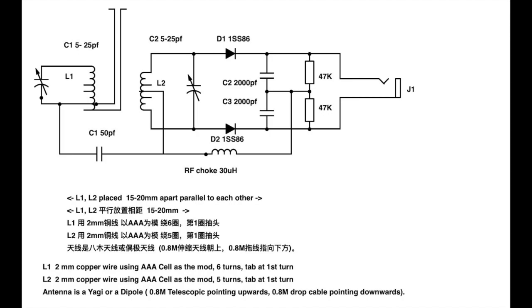So how this Foster-Seeley circuit works — you can go to Wikipedia to check it out. Basically, the Foster-Seeley circuit operates using a phase difference between signals. To obtain the different phase signals, a connection is made to the primary side of the transformer, or our L1-C1 circuit. Using a capacitor — we use 50pF — and this is taken to the center tap of the second tank, the second resonant circuit created by L2-C2. This gives a signal that is 90 degrees out of phase from that of L1.